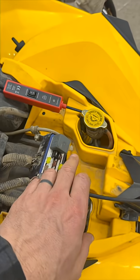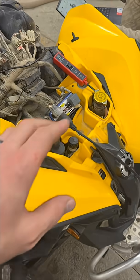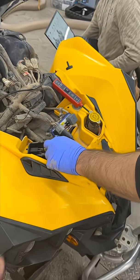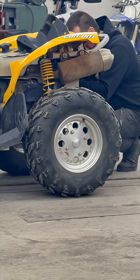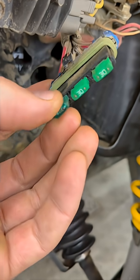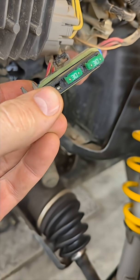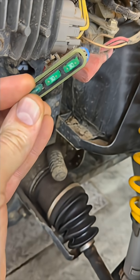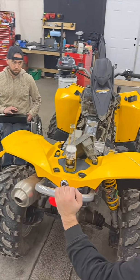We jumped power and the fan is still not turning on, so we most likely have a problem between the relay and the fan — that's the next logical thing to check. Jake had a brainwave: there's a 30-amp fuse here. This one is nice and tight, but that one is all loose — you can see the difference in the gap. Bingo, it works!